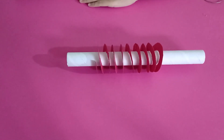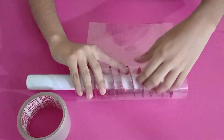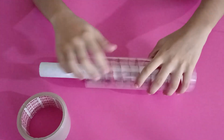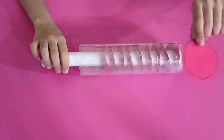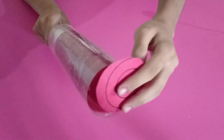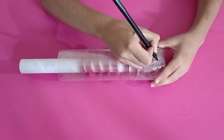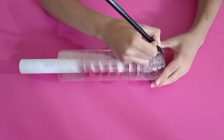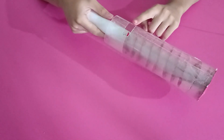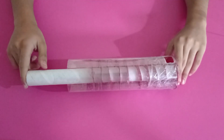Put these rings around the tube making a spiral along the length, keeping the ring starting points equidistant. Apply glue to fix the spiral rings. The plastic sheet is rolled around the screw to snugly fit and not leave any gap. Tape it to make the casing. Use a cardboard circle to seal one end of the casing. A small opening is made near this end to allow material to enter the screw assembly — this is the inlet — and the outlet is at the top of the spiral on the opposite side.